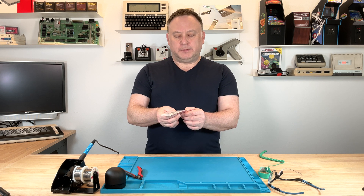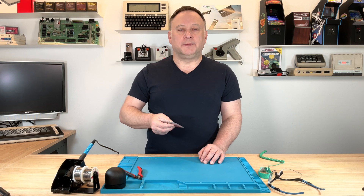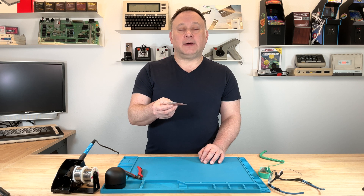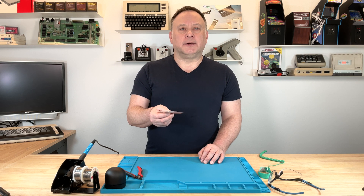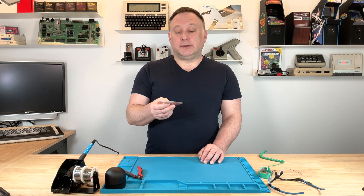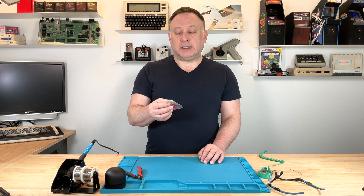It's a kit, so it comes with the board and all the parts for it. If you don't want to take an SIO cable and cut it in half and connect it to a breadboard, you can use this. The nice thing is it comes with parts including a voltage regulator to bring the 5 volts on the Atari's SIO port down to 3.3 volts, and a little LED to show you that everything's working. So it's really nice if you're going to use some external components — a microcontroller, a microcomputer — and want to drive that fully off the SIO port with 3.3 volts. It's a nice device if you're going to play with some components and do some testing. Let's check it out and solder it up.